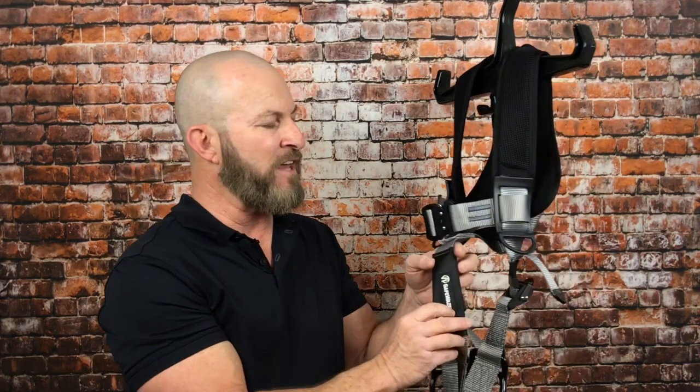Now, when you receive this harness, the first thing you want to do, when you get it out of the bag, is locate this tag that's in the back. It's Velcroed, and what's below it is all of the information about this harness. Remember, OSHA states that we have to inspect the harness twice a year by a competent person and note it, meaning all of this information is going to be noted, right? It's identifying this particular harness.